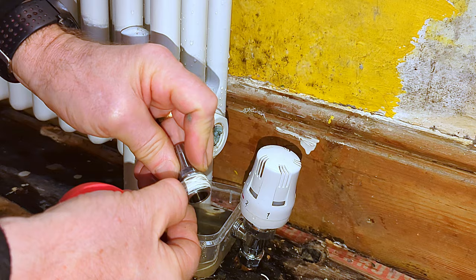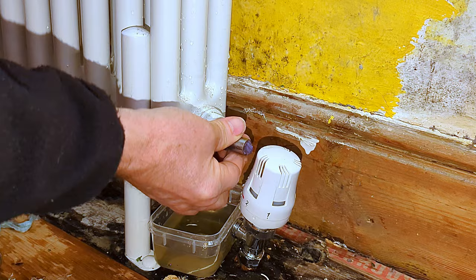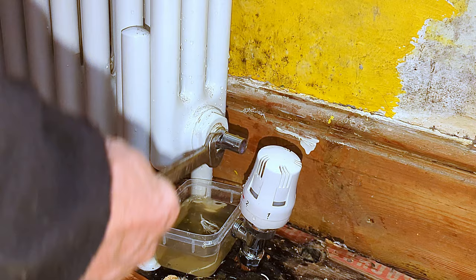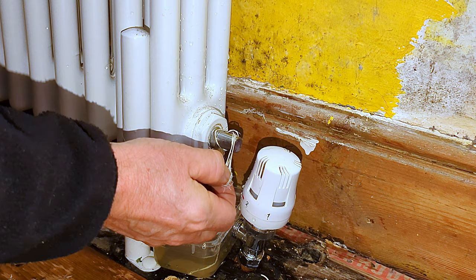Once again I pop a bit of paper into the end of the tail, pull the other bit out of the radiator — expecting some water to come out — and now I can pop that in and screw it up nice and tight. Already as I'm doing the tail up I can feel it getting tighter, and there's still plenty of thread showing, so I think this tail is a much better choice. If you'd like more detailed information about replacing radiator valves, I've made other videos on that in the description below. I'm much happier this time — it's gone really nice and tight with far less cord coming out of the joint.